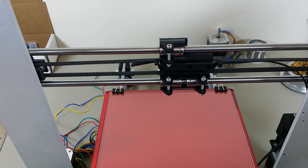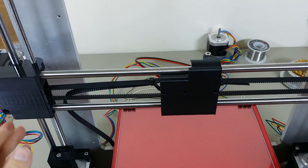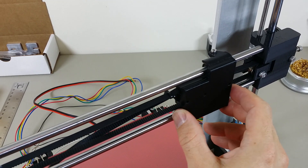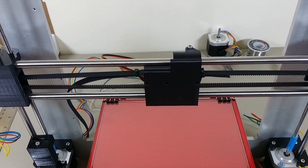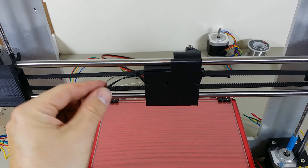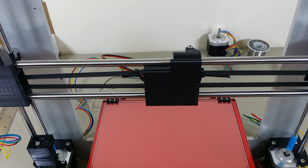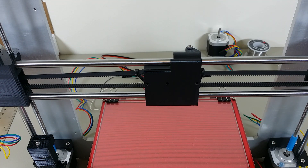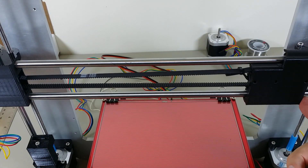Check the pulley and the bearing to make sure that they're lined up right. I'll go ahead and flip it around and check. Looks good here and it looks good here too. Now I can go ahead and snip off the excess belt — leave a little bit on that side and clip quite a bit off this side. As this side goes back this way it's going to try to feed into the idler, but that should be fine right there.